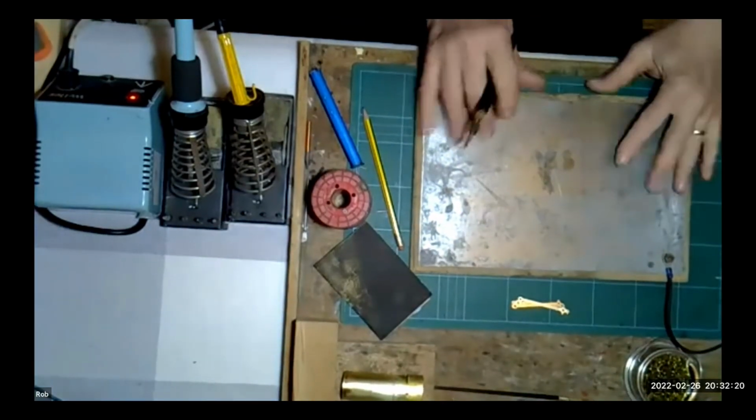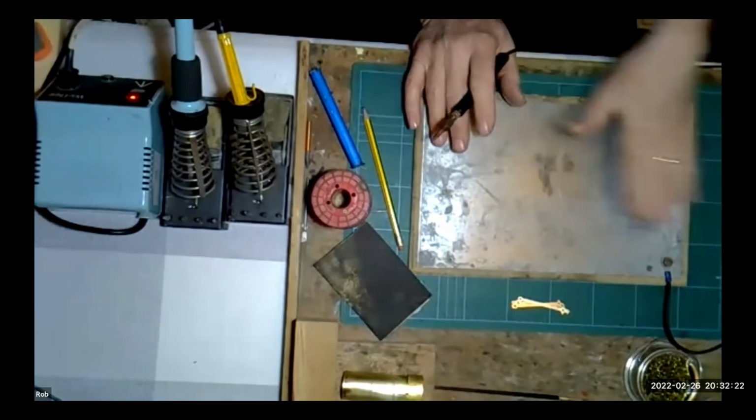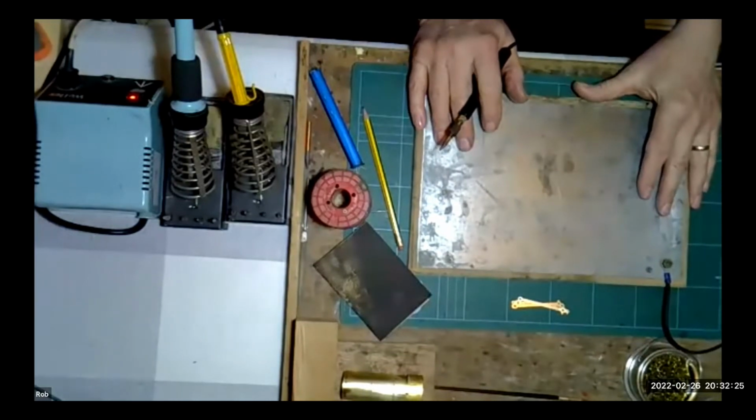There's a couple of comments come through on the chat. From Dave Smith, he's saying there may be some confusion when referring to the ground plate. You mean ground as in earthed, as opposed to ground as in ground flat. Yes, we're referring to it as an earthing plate. It's basically the other potential as opposed to the actual probe. It is the ground, not ground as in ground flat stock.